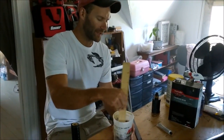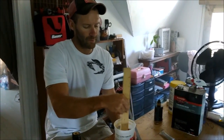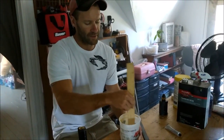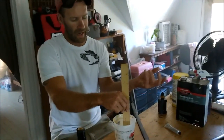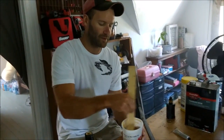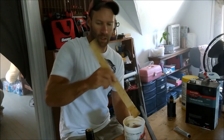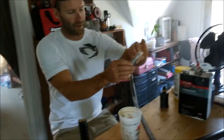And the little trick I did when I was doing the drops, you'll learn it when you're messing with this stuff a lot: you'll get down to where you don't have enough pressure in the bottle, and then you let up at the same time as you're turning it, let the hardener come down, then keep pressing on. That'll make more sense once you mess with it. It's so you know, when you're doing larger batches, you have to reset your positioning, because eventually you're going to run out of air in here.